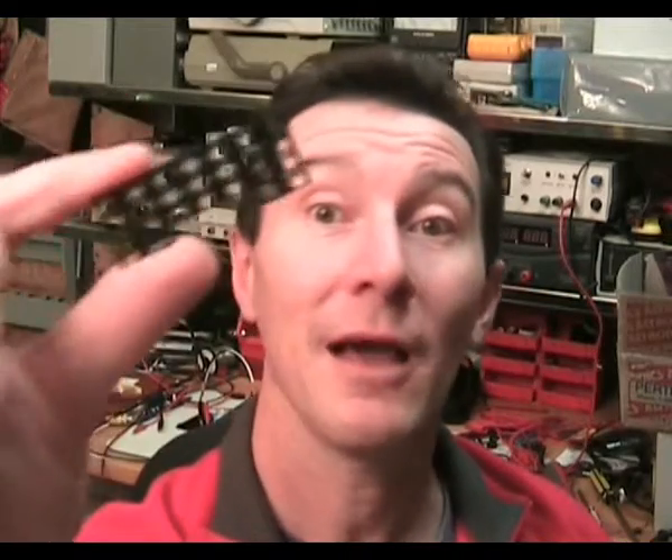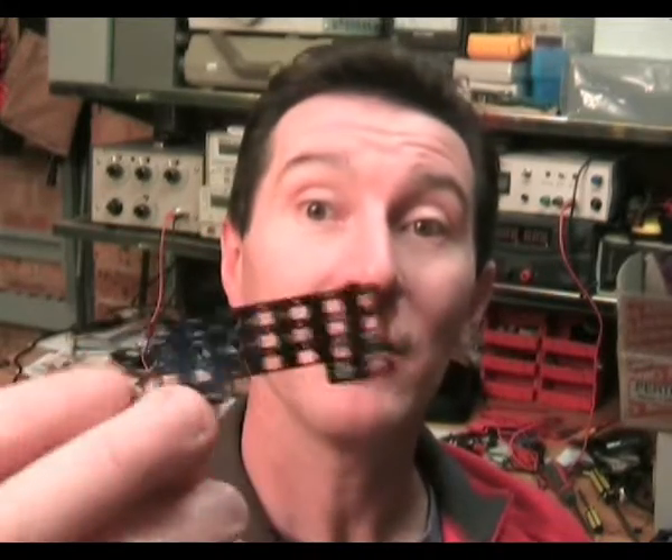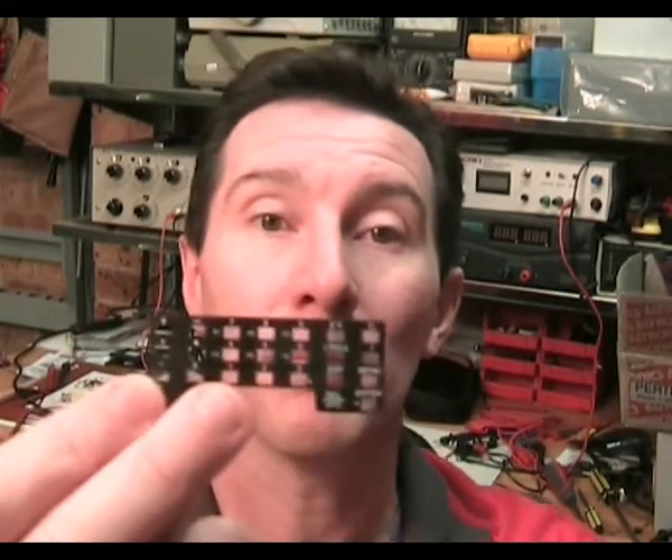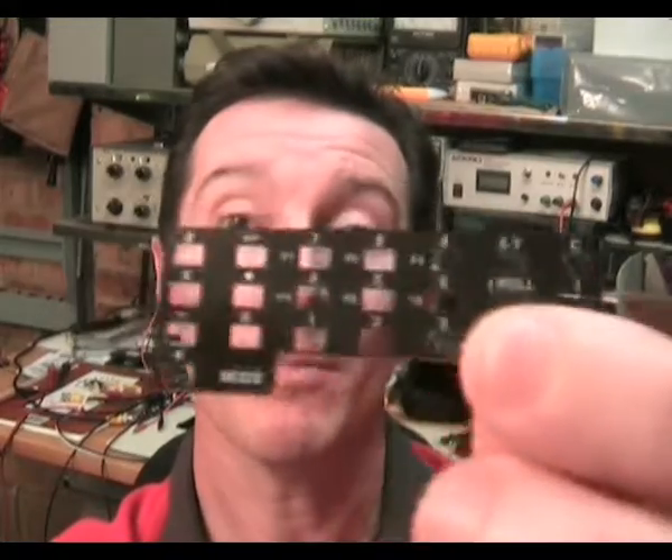Because I was familiar with PCB design tools, this was a piece of cake — I lashed it up in five minutes. You can have a professionally produced front panel made out of FR4 fiberglass, and you can get these made cheap and simple. You can get a range of colors — green, blue, red — but I chose black because it matched the rest of the watch. So I got a black gloss solder mask and white silkscreen, and it worked out really well.